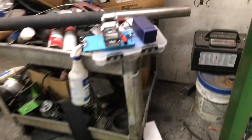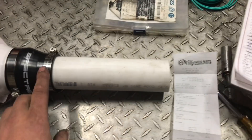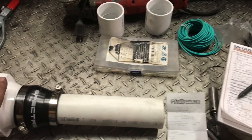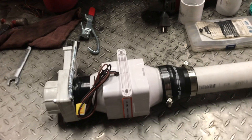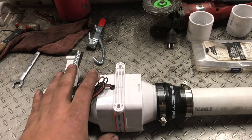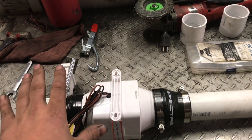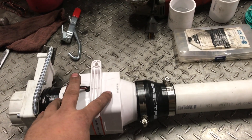I'm still going to have to adapt this once again to the 2-¼-inch exhaust, which is what I made the air intake system out of that comes out of the heat exchanger. This will go over to the heat exchanger and up to control air coming into the system. This gives me the option that if I want to be super stealth and show no smoke, I can pull into somewhere and park, flip that handle, and it shuts down the whole system — no smoke shown anywhere. At least that's the idea.